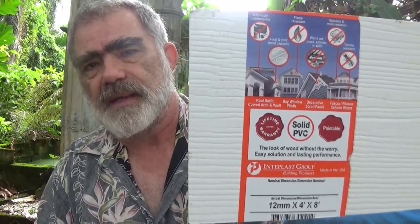So I decided to make a system where you need no external hardware, no paint, nothing. It lasts essentially forever - as many pours as you're ever going to do - and it's a lot cheaper than wood. It folds flat so you can stack them on a pallet and ship them. Buy a 4x8 sheet from Home Depot and you can make two molds out of it, which equals one bag of cement per sheet.